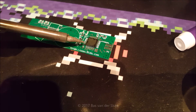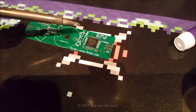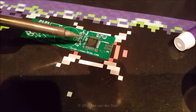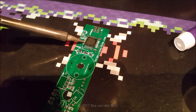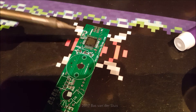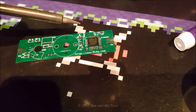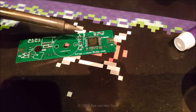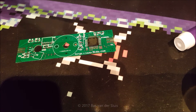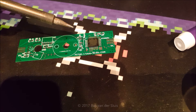I can test for continuity by putting pins on there, to see if there's contact on the IC and on the pad. But my main concern is that because the continuity tester uses power, I might be shorting out some pins — touching one pin and another — and having power flow through the IC which is not supposed to, and I might damage it. So I'm going to inspect it with a microscope and see if all the pads are soldered. I'm going to connect my microscope right now and see if the pins look solid and good enough.